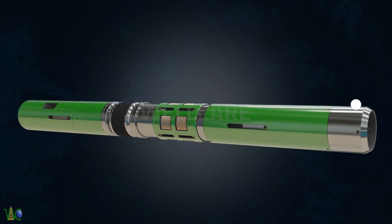Threaded bottom subs are provided as separate items for running gravel pack flow subs, seal bore extensions, or tubing tailpipes of varying types and sizes.